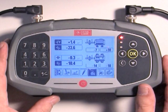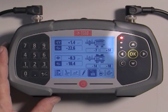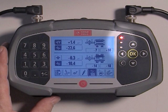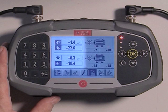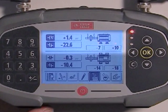The screen automatically displays the results. The LEDs indicate whether the alignment condition is within tolerance: a green light indicates the couplings are within tolerance; an orange LED indicates alignment is out of tolerance by no more than two times the tolerance values; and a red LED indicates misalignment of greater than twice the tolerance values. Angle and offset values show the alignment condition of the movable shaft relative to the stationary shaft in both the vertical and horizontal planes. The feet values are used for making corrections. Even though the displayed results aren't live, the GO continues to monitor shaft position with its true position sensing function.